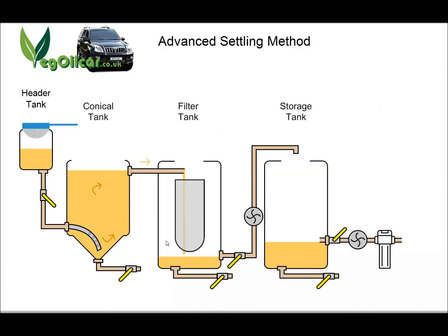The oil then stores inside the filter tank, and the level keeps rising until you manually take the oil out. You could do it the hard way with a tap and bucket, or attach a pump. I would suggest using a simple drill pump — they are very cheap and easily replaceable. If you keep them in the system with oil inside them, they'll last absolutely ages. So just attach a manual drill, whizz the pump around, and extract the oil from the filter tank into the storage tank.